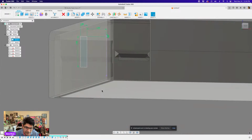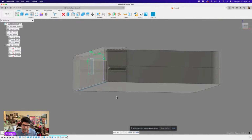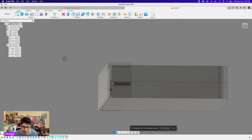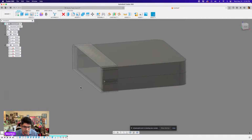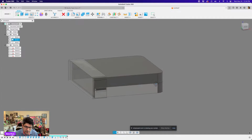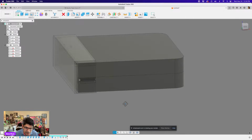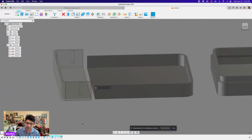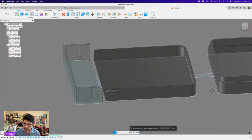And you are going to have that distance between these two surfaces for the top cover and the bottom half of the case because the live hinge needs to have a little bit of relief. But that's looking pretty good. That's pretty much how it needs to be. And then you can look on the inside there, and if all your clearances match up, it should work out pretty good. So let's go ahead and delete these move commands because we're going to start doing our live hinge. So bringing back that sketch number 1.